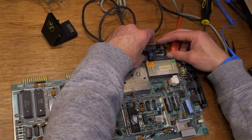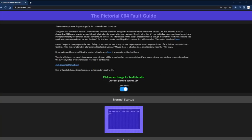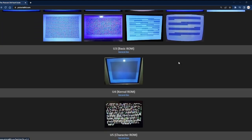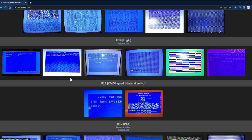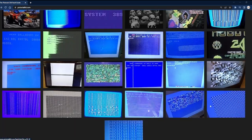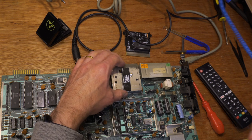Oh, right. An unusual pattern. I wonder what the C64 Pictorial Fault Guide thinks of this. It should be fairly easy to match it up. Link in the description for this handy site, or Google it, dealer's choice. So, we're looking for a checkerboard pattern. Oh, that looks promising. The VIC-2 chip, eh? I'm taking the VIC out.